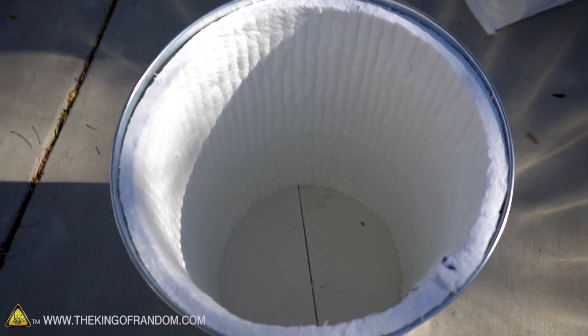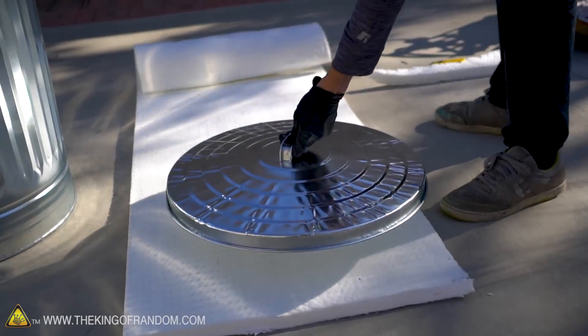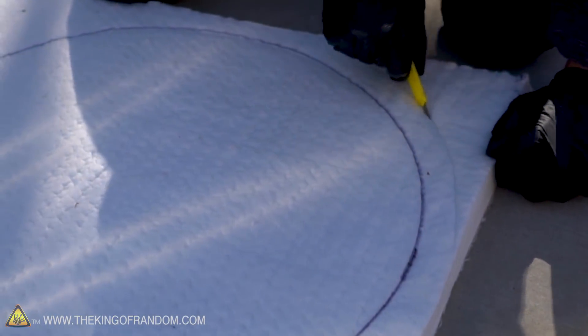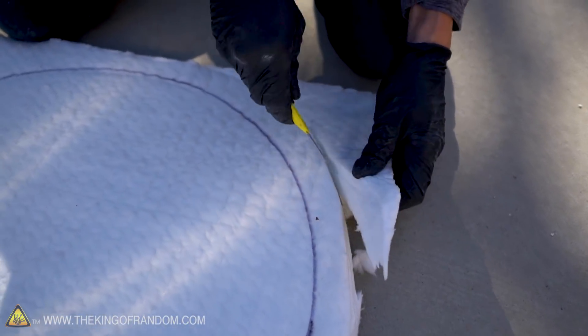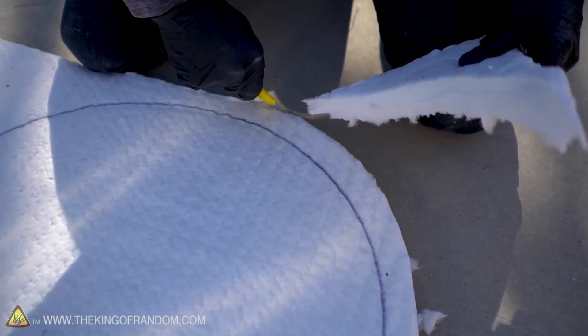The main body of the can is lined, so now let's quickly cut out a piece the right size and shape for our lid. I'm going to try a knife instead of scissors and see if I like it any better. I'm leaving an inch-wide gap — the same thing we did with our smaller foundry — so when we push it into the lid it will have a little bit of pressure and help hold it in place.